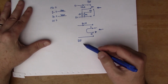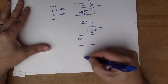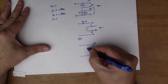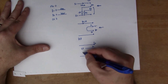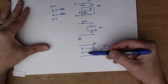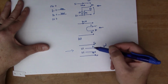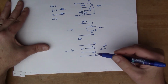However, this DCP specification, while many devices understand it, the Apple devices don't understand it, because what's happening inside an Apple device is you have the 5 volts, again 0 volts, D- and D+, and in order to specify that this is a high current charger, the charger has to present 2.7 volts here and 2.7 volts here. So the iPad, when you plug it in, is looking for the 2.7 and 2.7 on these pins, and if it doesn't see it, it will refuse to draw a lot of current. So what we can conclude from the devices that we looked at is that the IKEA one looks like this, where the Jackson multi-way adapter probably looks like this, and we'll be able to measure that using a multimeter, and I'll do that in a moment.